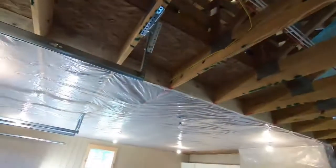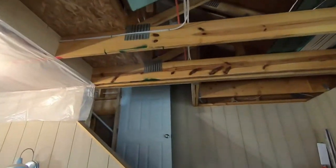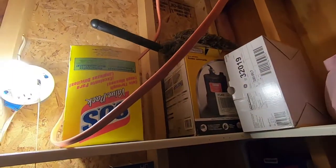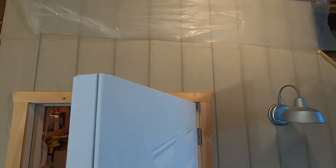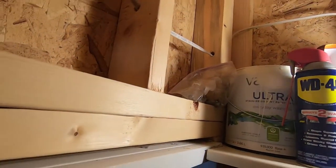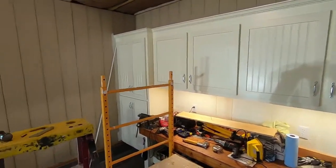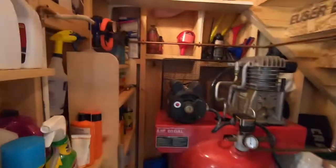We've got the number-10 wire — the orange one, the yellow one. It's going to be a 20-amp circuit because I'm going to put a couple plugs upstairs too. This 20-amp comes on down, takes a dip, goes in through here, around, and into here. We'll put a junction box there, then cut a hole in the back side of this wall — that piece of wall is where the mini split will go. When we come through the wall with the condensate and freon lines, they'll be in this corner. Then we'll drill a hole, take the lines down, and bolt them to the top of that cabinet right out the wall. We'll take the same route with the number-10 wire.